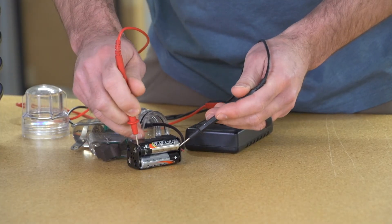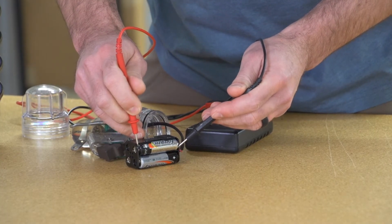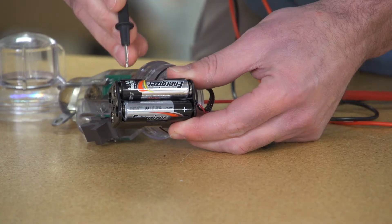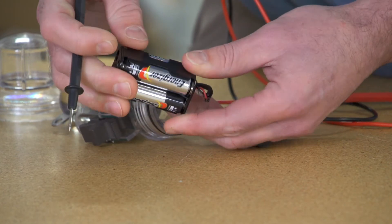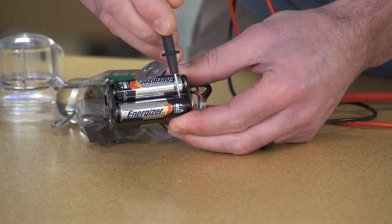Check your batteries with a multimeter or start with four fresh AA batteries. Triple check battery polarity because the probe will power on but won't send a signal if three of the four batteries are in correctly.